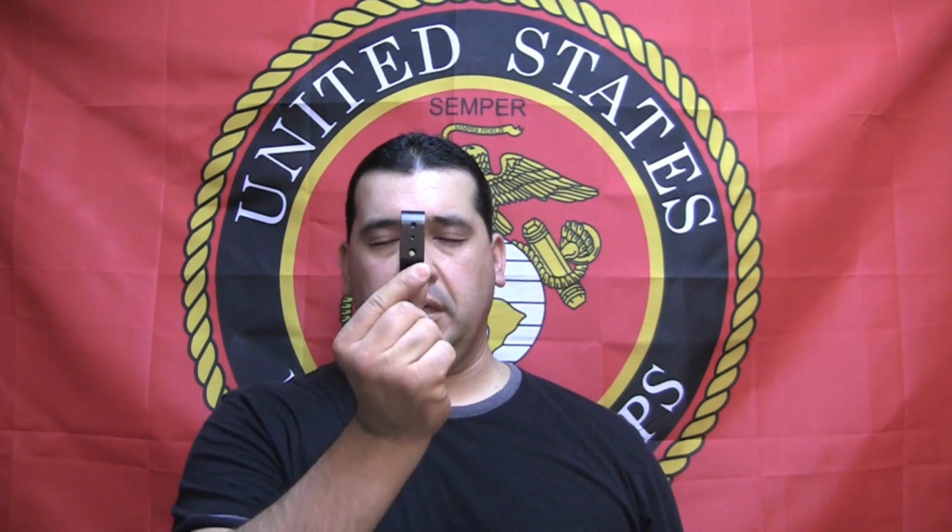Something that I forgot to mention in my previous video is that how this operating rod guide sits in the stock is adjustable by this screw right here on the bottom. It's an insert that takes a hex head screw, and you can back it out and adjust how this sits in the stock and angle up your stock while it's in the chassis, and you can optimize it for your accuracy. It accounts for variances in receiver dimensions from maker to maker, as long as they're not too far out of spec.